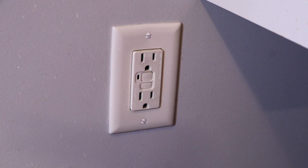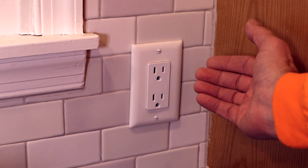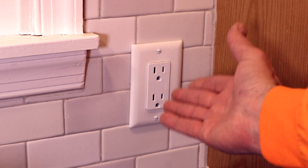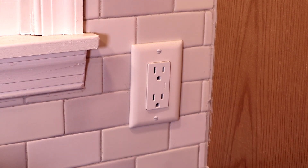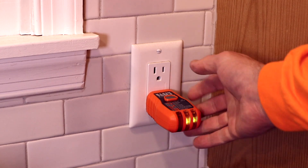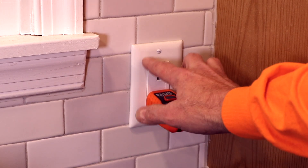Well, there's a good reason for that. For example, this looks like a standard outlet, but it's wired into another GFCI outlet which gives this outlet ground fault protection. The only way we can test that is to plug this transmitter into this outlet, and when we press the test button, it should trip the GFCI that this one is connected to.